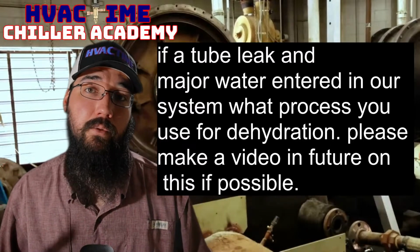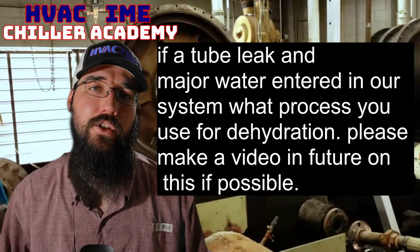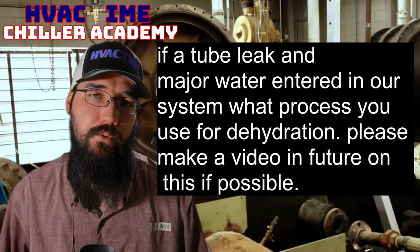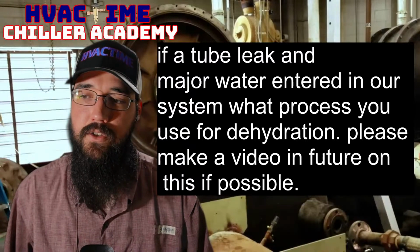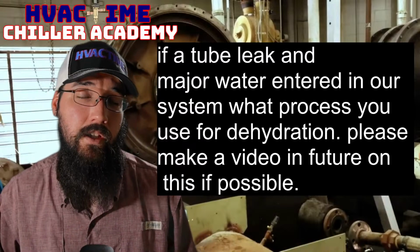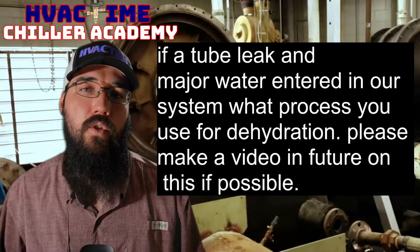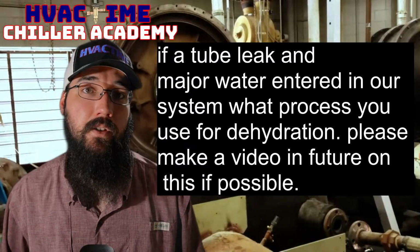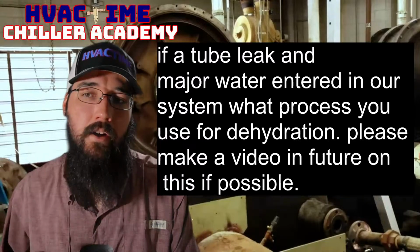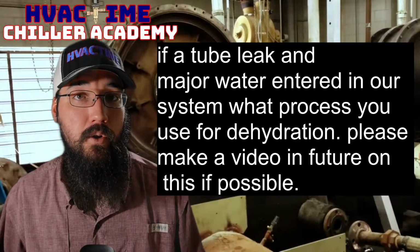And if you're going to go as far as doing a retube, and if that water got up to that compressor, like genuinely filled the chiller, then I overhaul for sure. I would really, really encourage that in a situation like that. Because if you try to skip any of those things and then you try to turn it on anyway, you only make your overhaul situation way more expensive and worse. So not only are you likely to tear up more bearings, tear up your seals, tear up your impeller, you could also mess your motor up as well.